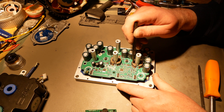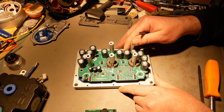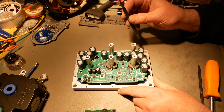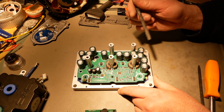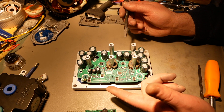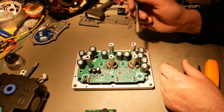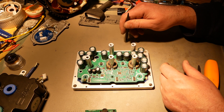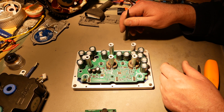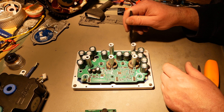Right here are two current sensors for phases, and then this third phase doesn't have one — we've seen the same thing in the KO Pro controller. There are some aspects of this, like these two current sensors, that would lead me to believe this is FOC. I know Far Driver says it is, but there should be evidence of that. In the application for setting up the controller, the evidence is pretty scant — there's not a lot that says yes, this is definitely FOC control. So I'm looking for it in hardware too.